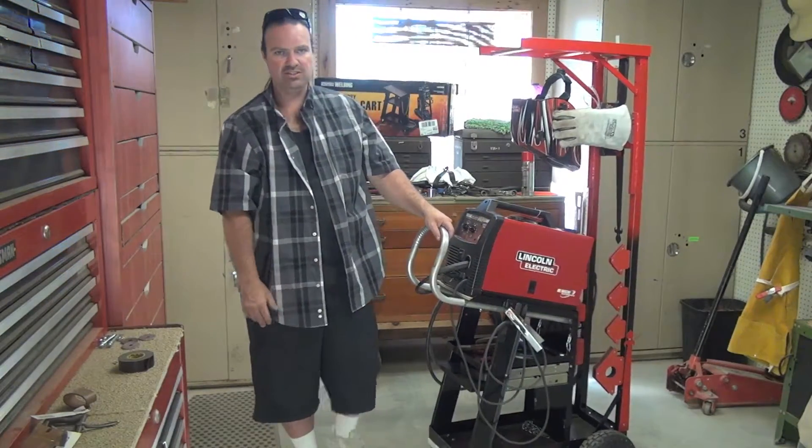Let me show you the handle. I got it from an old boat that I restored — it was the back-to-back seats. I had to notch the original flange because the Harbor Freight cart didn't come with any handle. I put a nice little one-inch hole through there, and it goes all the way down through the back and secures from the back, plus a couple of bolts going through the top and bottom.